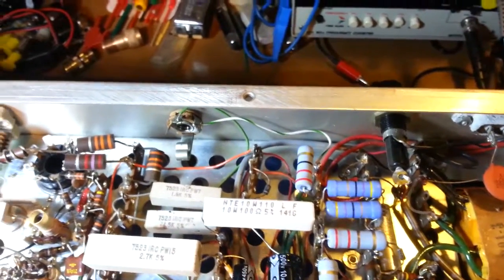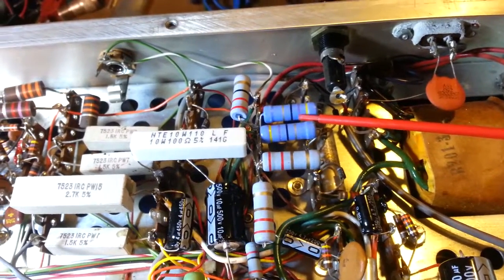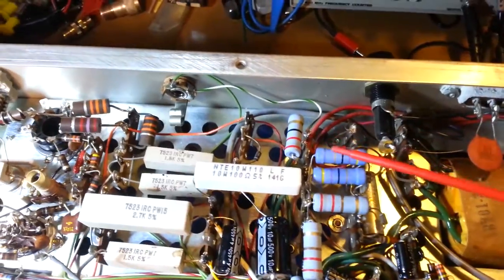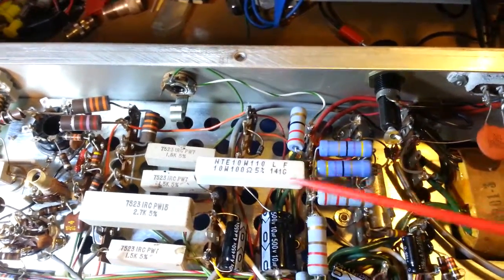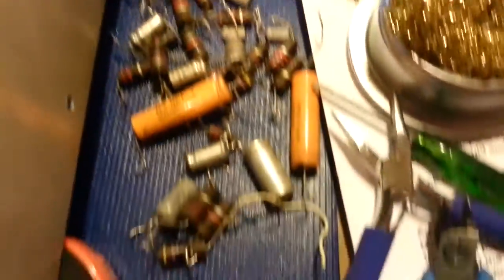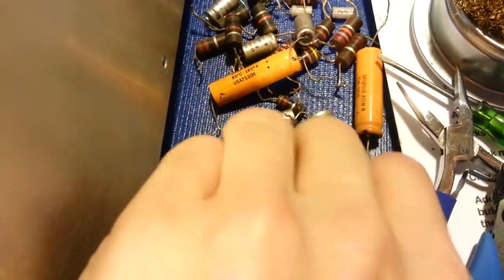So all of the tubes receive their high voltage through these 2 resistors that are in parallel and then this ceramic resistor. So you really don't want to be messing with these. Well, that's exactly what somebody did. If you look down here, these are all parts that have been replaced so far, and one thing you'll see down here is a little piece of wire.